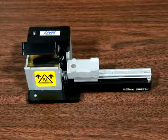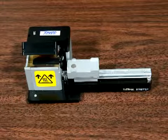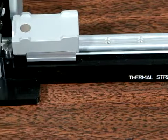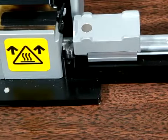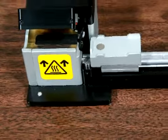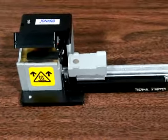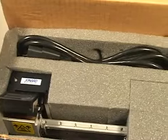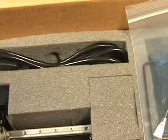The Jonard T-SFB125 thermal stripper is designed to thermomechanically remove acrylic coatings from 125 micron glass optical fibers, including 250, 400, and 900 micron coated fibers. Each thermal stripper kit contains a user manual, a thermal stripper unit, AC power supply, a cord, and a cleaning brush.